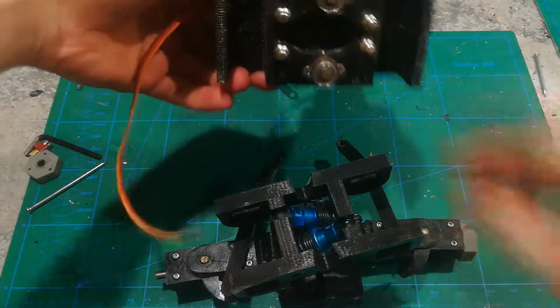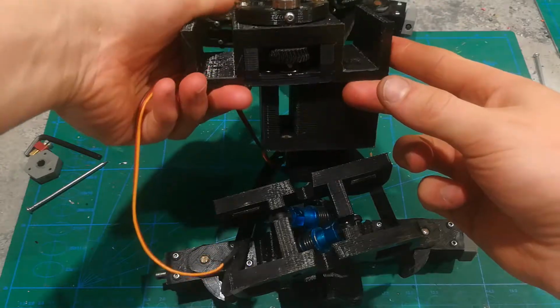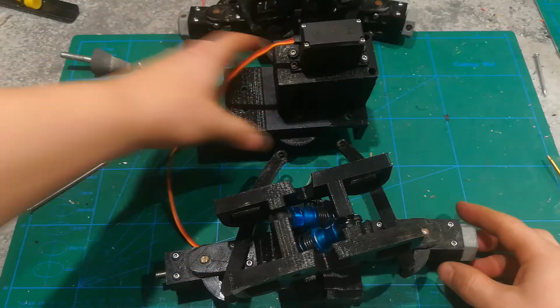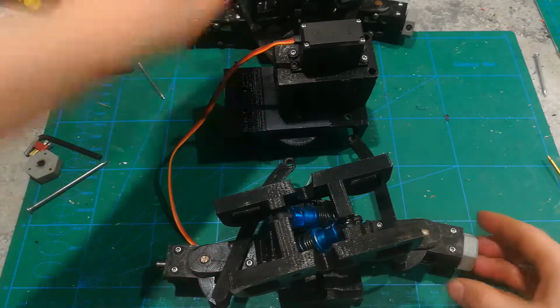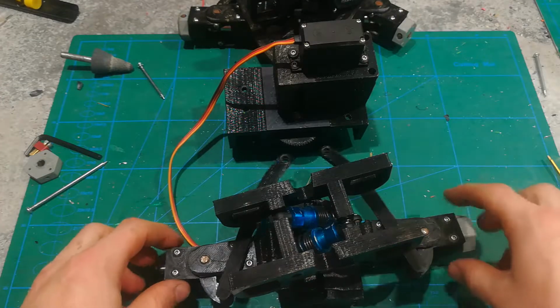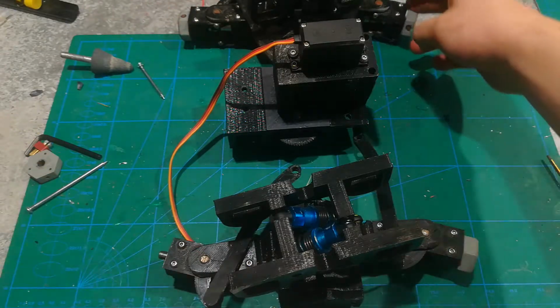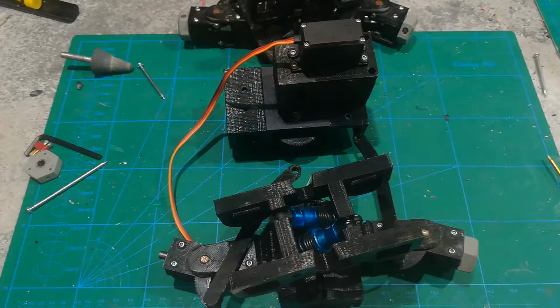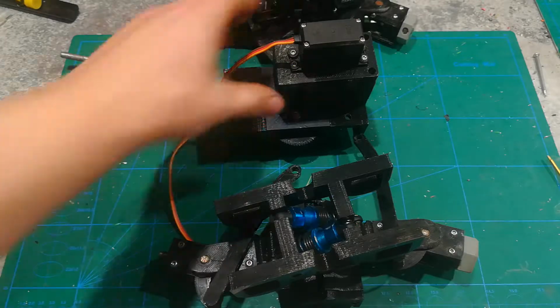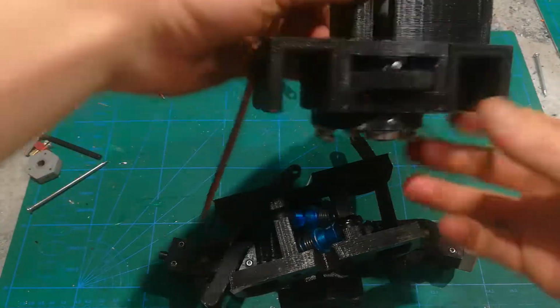Now, this thing uses these two linkages that are turned by gears of two different sizes. So this second axle actually always turns a tiny bit less than the front, so that you can actually turn properly. Because if these turn the same amount as the front, it would steer pretty weirdly. As you can see, this is a very simple setup that I've got going on here.